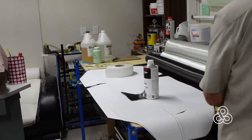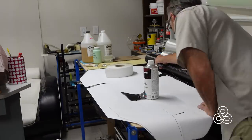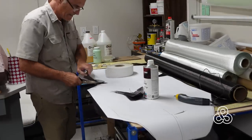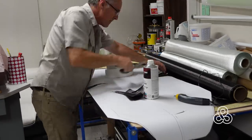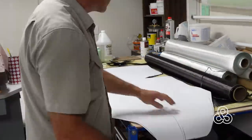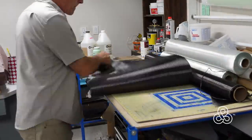I've made a little paper template to cut my carbon and glass fabric pieces to size. Always cut them a little bit bigger, especially if you don't want any seams to show when you're doing a carbon surface.